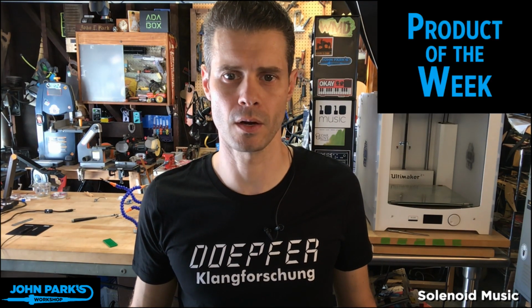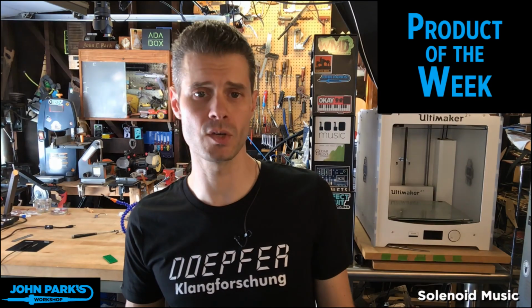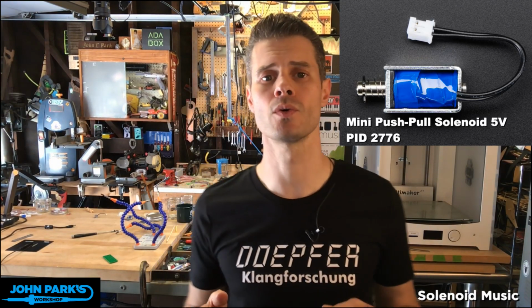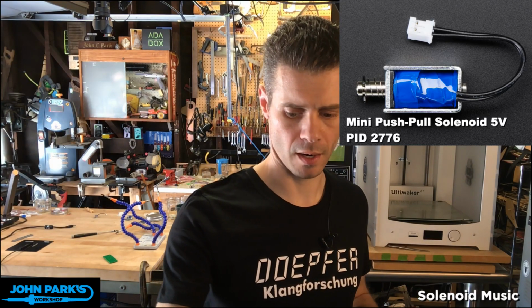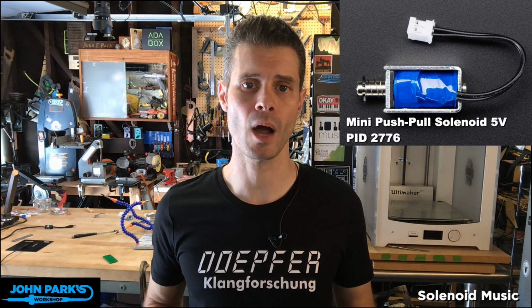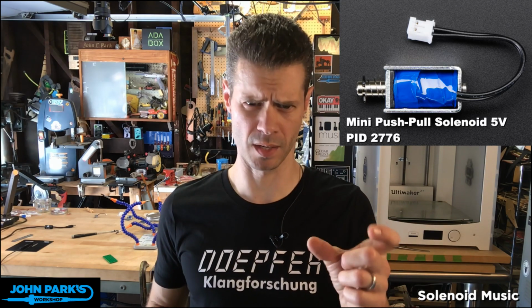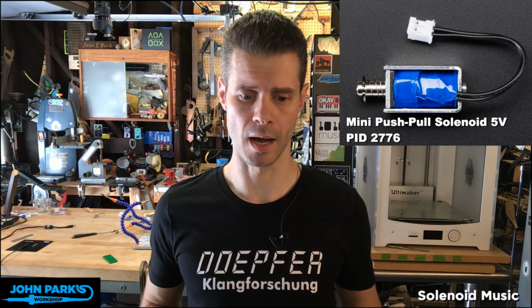Okay, so let's now move on to a quick little product of the week. Fix my camera again. Product of the week is something we're going to be using today, and that is this delightful little push-pull solenoid. This is a 5-volt solenoid. A lot of the time when you go out and look for solenoids, you're going to find 12-volt. There's a lot of 12-volt solenoids out there. And those are great, but it can be difficult to find the 5-volt ones, which are easier to power from boards. You're going to need transistors. You don't want to run these straight off of your typical microcontroller board because they suck down a lot of current, about, this one, a little more than an amp when it's energized.